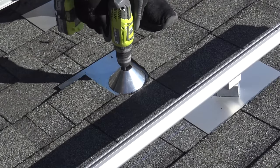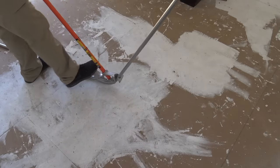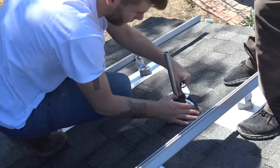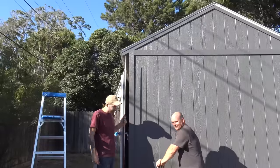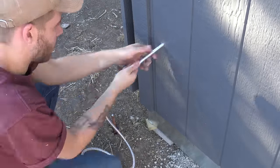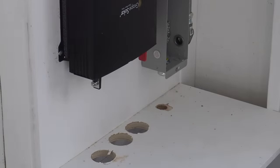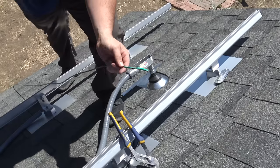We drilled a pilot hole from the top down and then used a hole saw to drill through the roof from the underside. We were now ready to bend some three-quarter inch conduit to create the path to channel the wires down to the charge controller. We added a conduit body and then checked to make sure that the solar panel fit over it. We drove a copper-coated steel grounding rod into the dirt and then drilled a hole through the shed so that we could run a jacketed grounding wire through. We drilled holes through the battery enclosure so that we could run cables to the inverter and to the fuse box. We then connected the grounding wire to the fuse box. We were now ready to run the wires through the conduit.